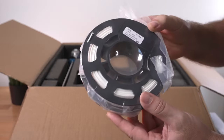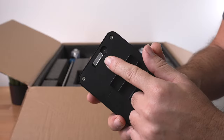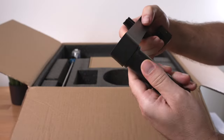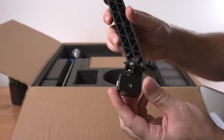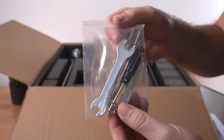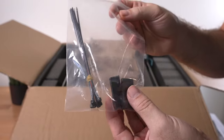Pulling things out from the top: we do get a spool of filament, 200 grams in white PLA — I like how they included a spool. We've got our touchscreen display in its own little housing with a speaker beeper and pre-mounted hardware. Here we have the spool holder, pre-assembled, with the filament detector already attached. In the accessory box: snippers, four long bolts for connecting the gantry to the base, Allen wrenches, a flat screwdriver, open-ended wrenches, a sharpened spatula, a cleanout needle, an extra 0.4mm nozzle, zip ties, two end caps, a USB card reader with micro SD card, and a US-type power cord.